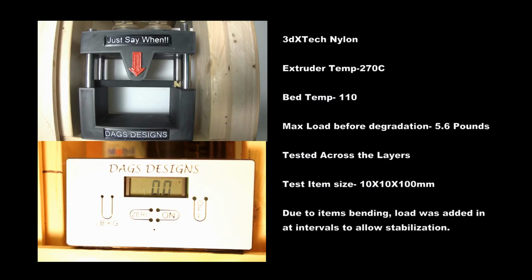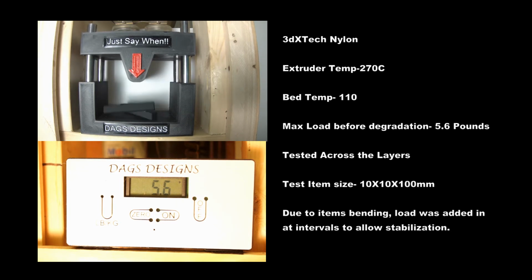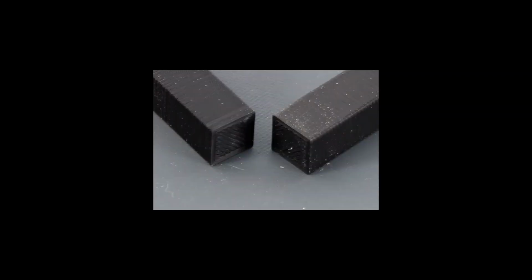If you look at this next video, you're going to see just how fragile it is in the other direction though. See, that nylon didn't even hold hardly any weight at all. If you look at the part here, it looked like they weren't even glued or adhered together at all. So my nylon was still not hot enough at 270 C. I'm going to crank it up to about 275 or 278 in my next test. As you can see here, you can see each individual layer in there. There's hardly any melting together of the material. And this isn't good. This is kind of a failed test.